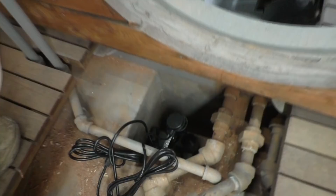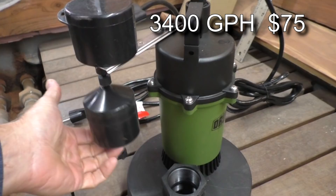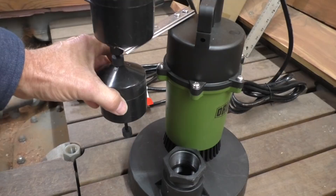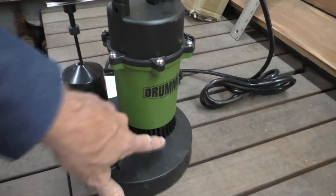Here's the pump I want to use — this is a Harbor Freight sump pump. It's a nice 110-volt design and it's got a float switch that's vertical, so I like that. I've used the float switches on a tether and they get jammed up and tied up to things a lot, so I have a lot more confidence in this one. It comes on when it touches the top and shuts off when the weight goes back to the bottom. It's got an inch and a half discharge, reducible to an inch and a quarter, and the water gets taken in through a pretty big screen.